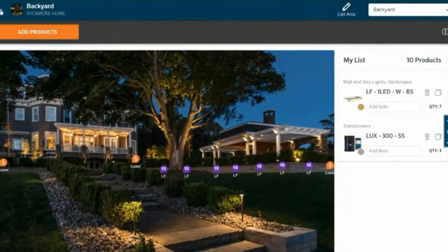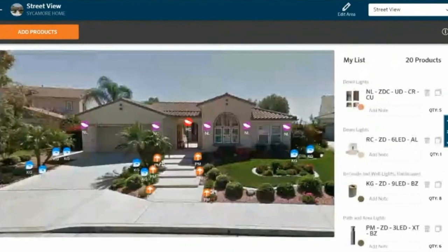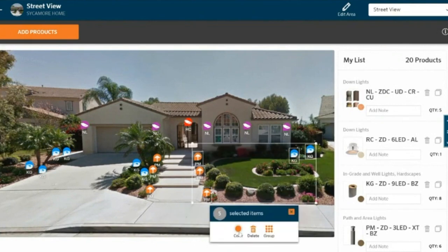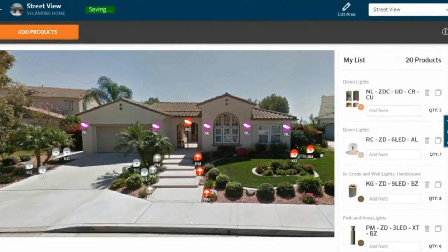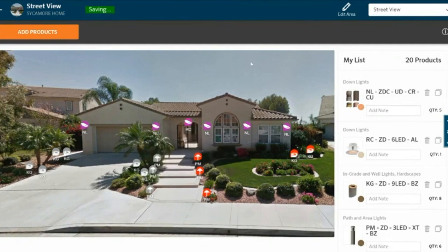Let's go back to the front view for one final bit. I'm feeling like this is getting a little bit too color-oriented for me — too much color. I want to change the way I'm thinking about this. I want this to be associated with how I'm installing the product — specifically, based on the wire run. So maybe all these fixtures are on one wire run here, and maybe all of these fixtures here are on their own wire run. This one is probably going to be on the same wire run as the downlights because it's all on the 120-volt side. Now I have it divided into three different sections.